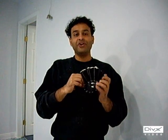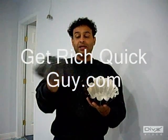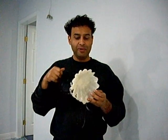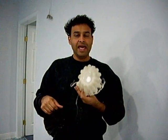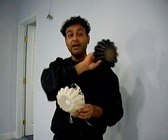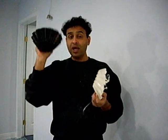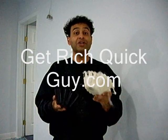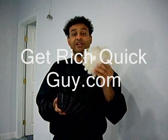So here is the mold after it has cooled. And if I take this piece apart, the piece inside of it has formed very well, actually. And this is just by pressing the two halves together. Remember, these two pieces were not heated at all — if I was to heat this, the plastic would have flowed much better. So I think that it is possible to have a press mold without an actual injection mold if your part is simple enough and you can heat the actual form so that the plastic will continue to flow and not solidify.